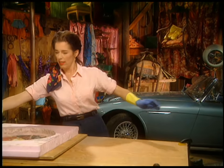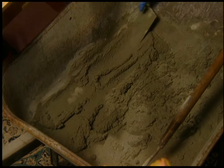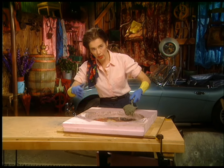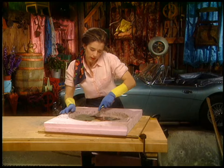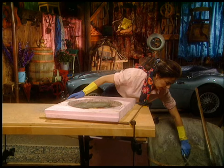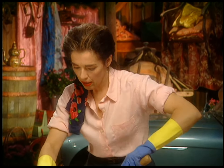I'm going to slide this over so it's close to my wheelbarrow, and use the drier stuff on this side. I'm going to start at the edges and work in, so that way the pieces, if they are floating a little bit, will push to the middle rather than to the outside. It's really important to vibrate it a little bit because there are bubbles, and you want to get the bubbles out if you can. Once everything is covered, just smooth it out a little bit.